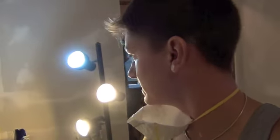2 hours into day 5, I got a second coat of mud. It's easier when doing corners. I just did this wall, and then I did the ceiling on either side, because if you try to go and do the ceiling and then the wall, you can end up pulling a little bit of that ceiling coat away. So it's just kind of frustrating. I mixed up some 45-minute hot mud so it'll dry faster. Hit a couple of these lines.